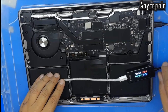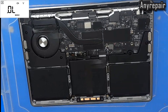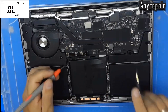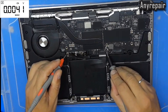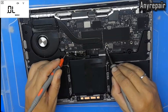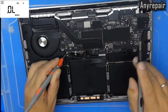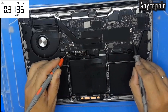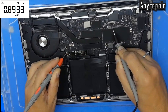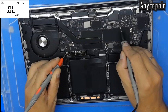So we must find out the reason. Let's check with our multimeter in diode mode. We will check for coil voltage drop. This one is good — this is the main rail. It is good. This upper coil is good. This coil is good. The big one is good. No short. No short too.